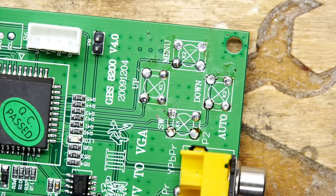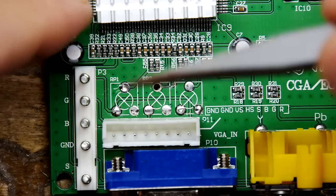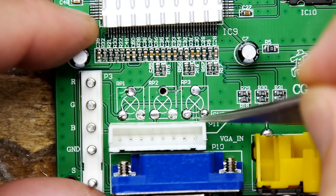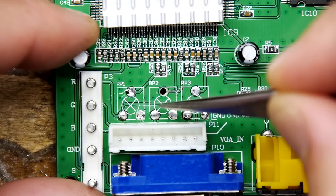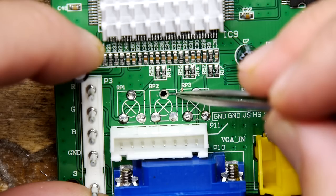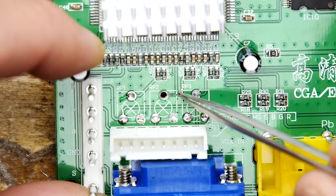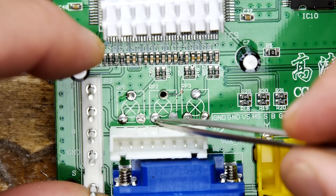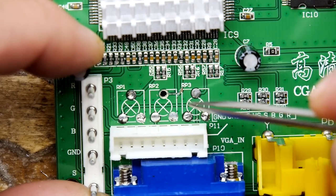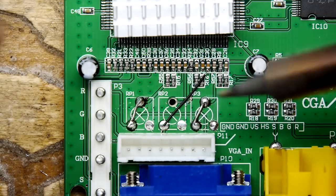These connections here - those were the three pots we've taken out - and they do need to be connected electrically so they're bypassed. These are basically ground; they would give you the potential divider taking them to ground, but we don't need that. So we're just going to bridge from here to here, here to here, here to here. I've dashed the track a bit - I was a bit overzealous - and you can see there's a damaged track. There's a via there, and the ripped track goes to here, so I'm going to put a little wire just to bridge that. These two here - R56 - are easy; they're not damaged, just bridge them.